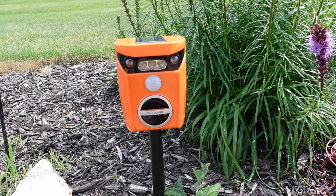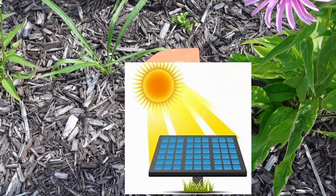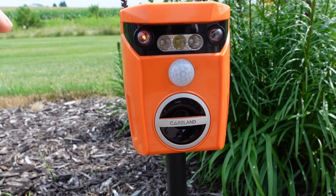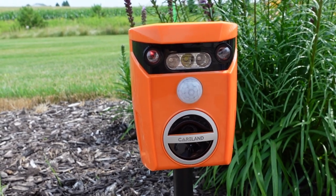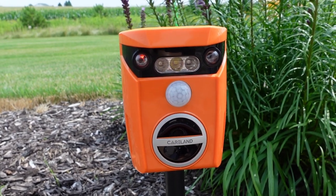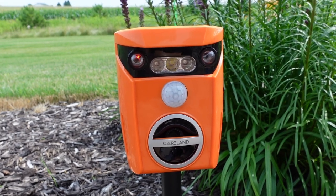Now a little bit about this unit. This unit uses solar power to charge its 3.7 volt, 600 milliamp lithium battery. The unit does have a red LED indicator light on the right side of it showing its charging status. When the light is red, it's charging with the solar or the USB. And when that light turns green, the unit is fully charged.